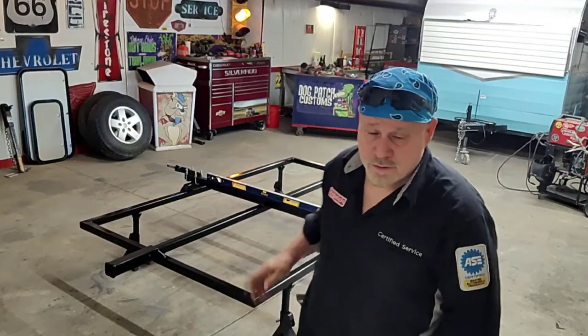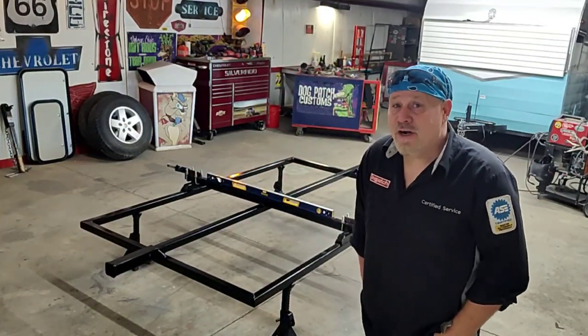The new channel and my first episode of the DIY square drop camper build. This episode is going to cover the frame basics. We're going to start with some raw steel I picked up off of Craigslist. That's a joke. We're going to cut it, angle cut it, chamfer the edges, clean up all the scale, go ahead and weld it together, square everything up, put some gussets in it.